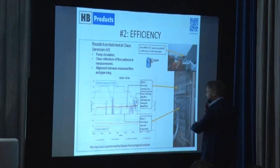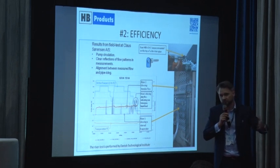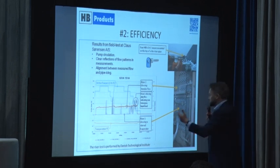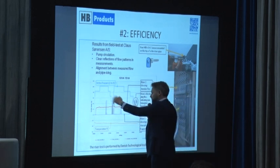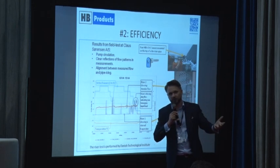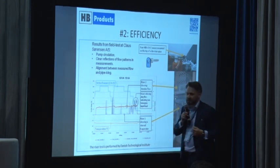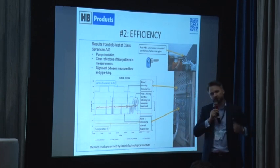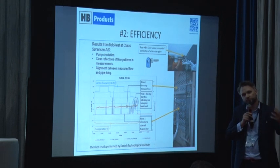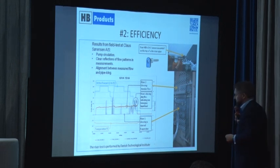The team found out that this evaporator, installed for several years, didn't contribute to refrigeration because there was no refrigerant. And then suddenly — blub, blub, blub — plenty of liquid, pressure drops, and you need to run your compressors hard to lift all the refrigerant out of the standpipes. So we use full compressor capacity at peak load here.